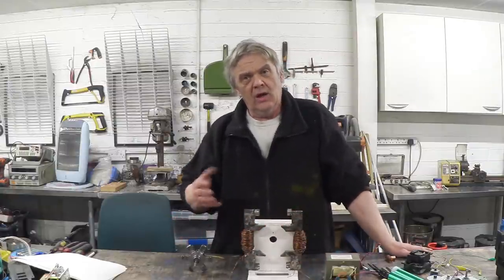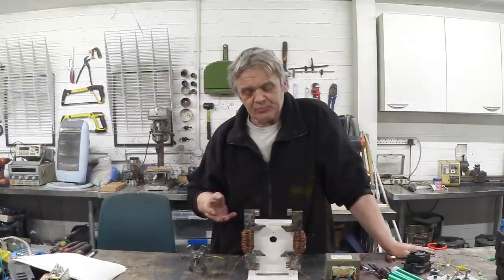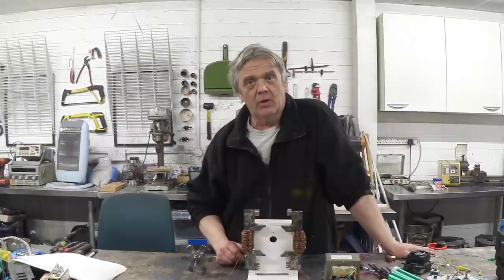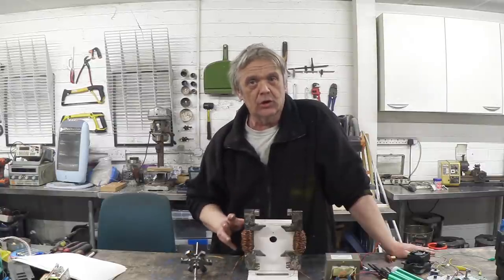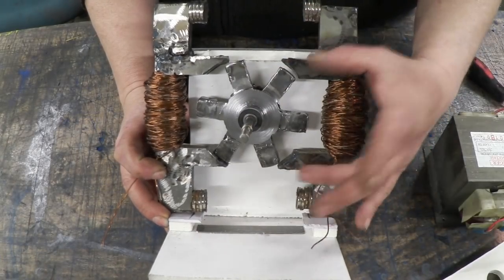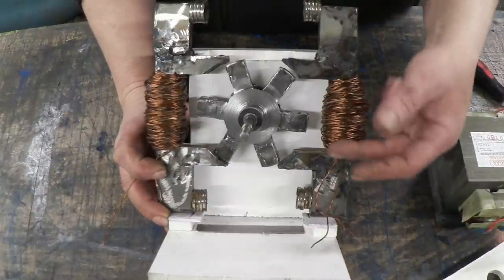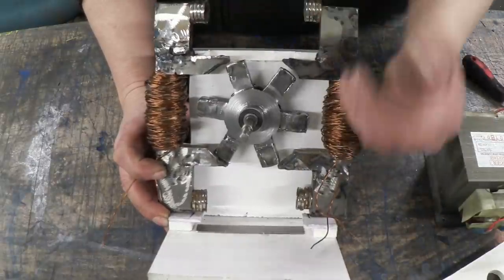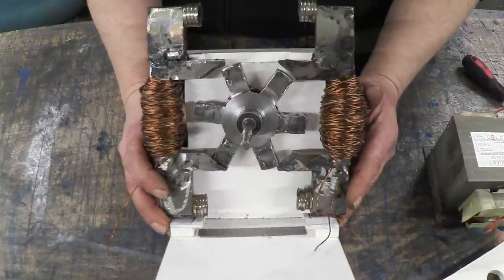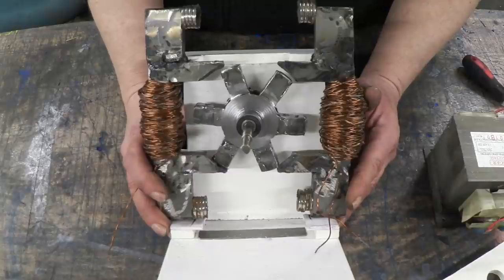So I thought I'd go through a little more on the difference between the generator and the motor, exactly how it works and something on the pole arrangements. Let me give you a quick close-up look at it. There's our six-pointed rotor with our four points on the two sides making up the armature. Magnets go there, coils go there — obviously it doesn't matter if the coils are here and the magnets are here. That's the arrangement in close-up and coupled with the drawings we've just looked at, you should be able to reproduce that.